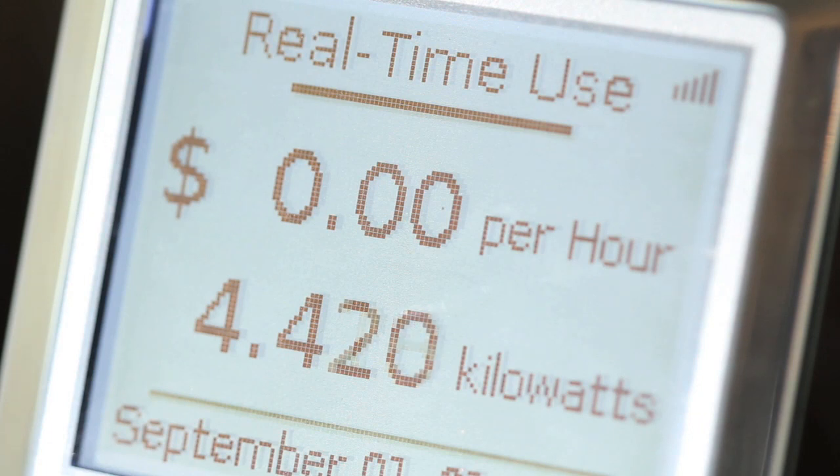We've now successfully installed and set up the TED 5000 and I can already see my kilowatt usage. If you don't see any data at this point, make sure you check for two common mistakes. First, make sure all the product IDs are entered in the product identification tab. Secondly, make sure the gateway is plugged directly into an outlet and not in a plug strip. I can now even customize my TED — I can enter in my utility rates using the utility settings wizard, and I can also create a load profile for my HVAC, pool pump, and other devices in my home. I can now see how much usage I'm using in both kilowatt and dollar amounts. I'm ready to save energy and money. Have a TED-tastic day!